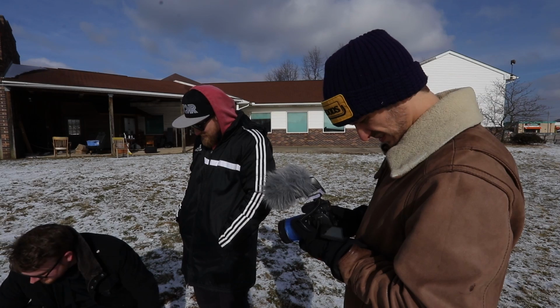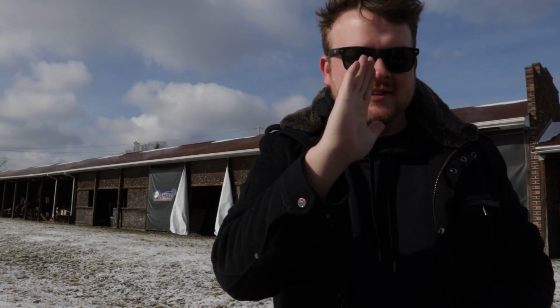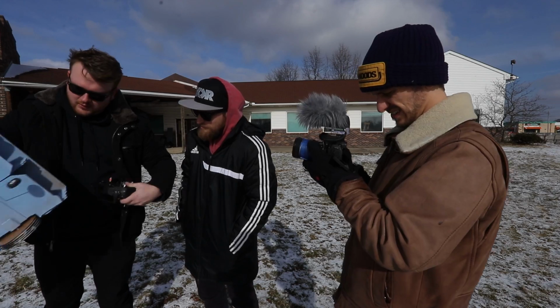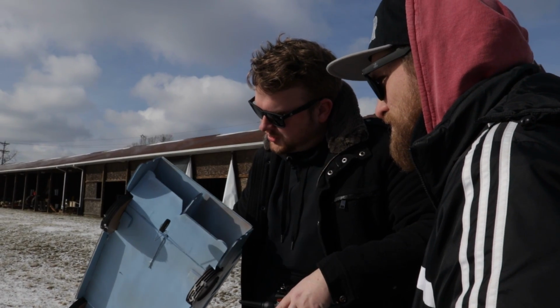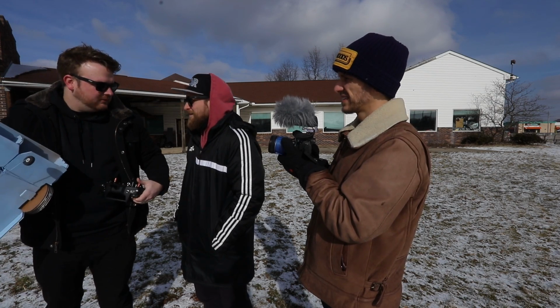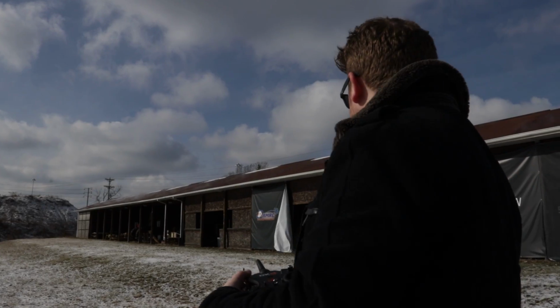All right. So what I just did there is I switched my approach. I'm going back to full-on elevons, and I took my rudder out. So the rudder is still in there, but it's just fixed. It's not going to be moving. And the reason why I did that is because the rudder was preventing these guys from having their full deflection. See how they would go up and hit the rudder? Now, hopefully, it's going to be a little bit more responsive. Take two, without a rudder.